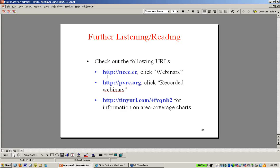I was not just being facetious by saying that if you have a vertical out on the beach in Guatemala, you will have a stronger signal than a 3-element Yagi at 60 feet with just a simple vertical, simply because of the way verticals operate over salt water.